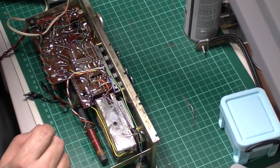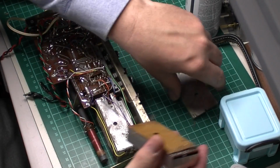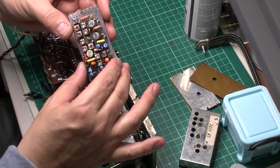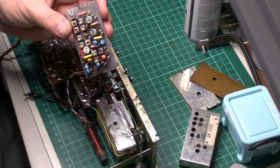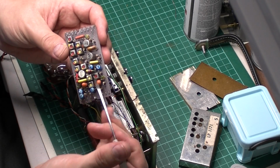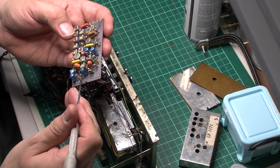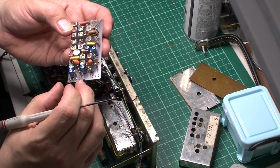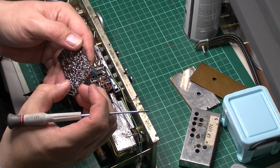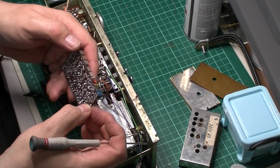This is the one I've just popped out. As you can see, we've got AF115, AF116 and another AF115 in this one. Board traces, the traces haven't broke, but the board's broken across to that resistor there. But it doesn't look like that's caused any issues.